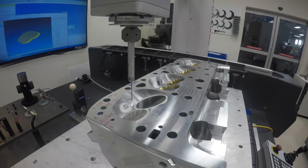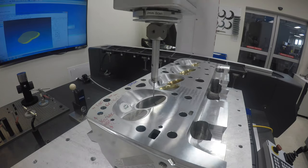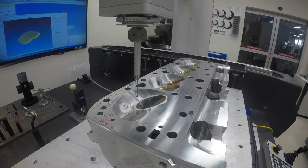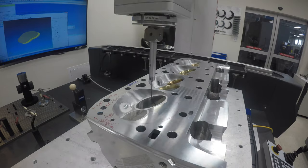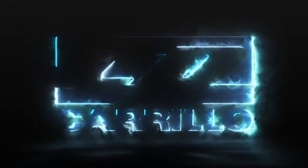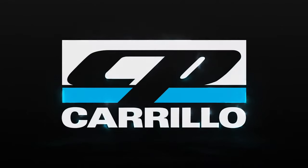This process allows us to automatically insert the data into our computer software and create a quick and efficient way to pull the domes into our SOLIDWORKS for a quick design evaluation. The efficiency is great for communicating with our customers and making sure they are getting what they need to create a high compression piston or duplicate a crown that doesn't need to be touched before going into their engine.